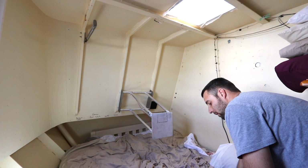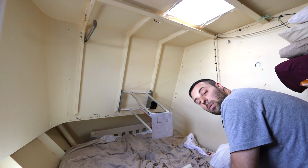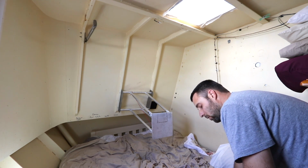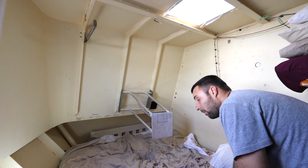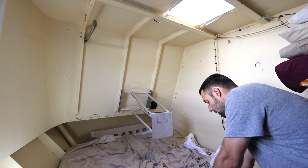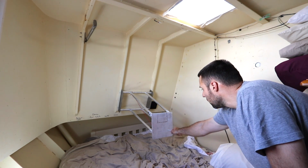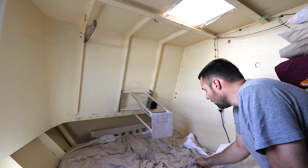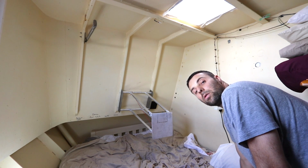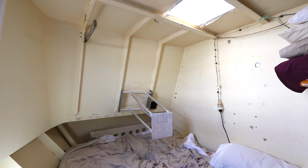So I'm basically going to kink this out like that, and it's going to allow this mount with no modification that's on the Apple, the standard mount, which also means that if we ever have to replace the computer, we don't have to muck around with it, we can just use the mount that's on it. So I'm going to chop that down. I'll drill and tap this mount because it's quite thick, and then I'll bolt from the back and thread it into the Apple stand, and that I think will do nicely. I'll then probably cut something in here for the cords, and then feed everything through. That'll keep everything central. I can also put some conduit around it as well. So alright, we'll pull it apart again and we'll get that built.